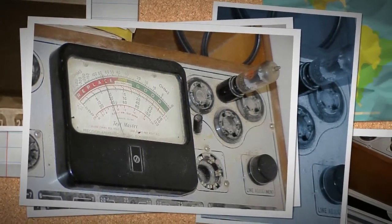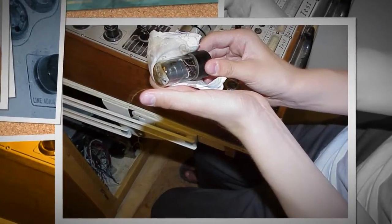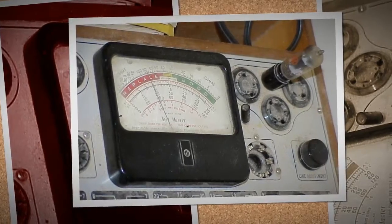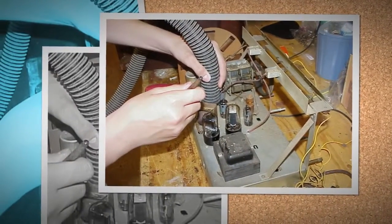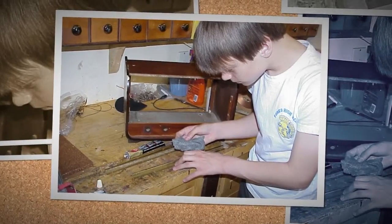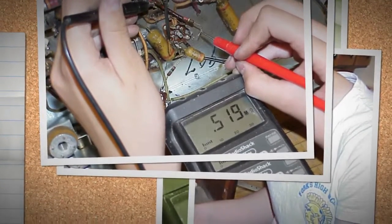Kevin also noticed the chassis mounting screws are missing. In one of the photos, Jeff is removing the chassis. We see the dust on the plates of the tuning capacitor. Looking underneath, we see a very clean chassis with no evidence of having been worked on. Jeff removes the speaker and then proceeds to clean and test the tubes. We find three weak tubes. Next Jeff cleans the chassis with a vacuum hose and brush.